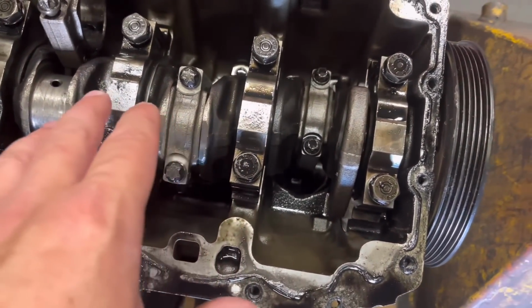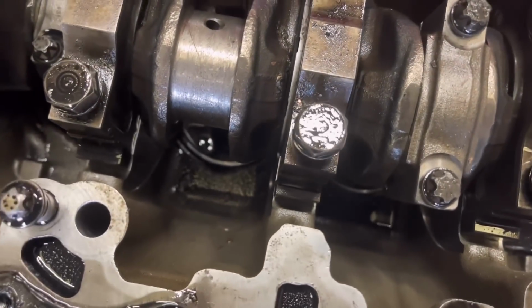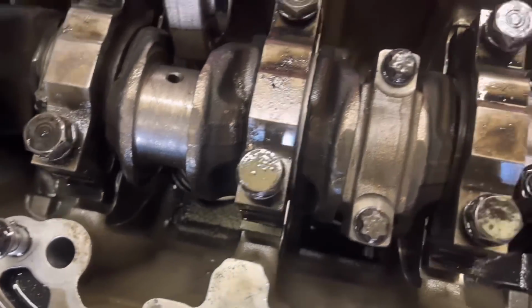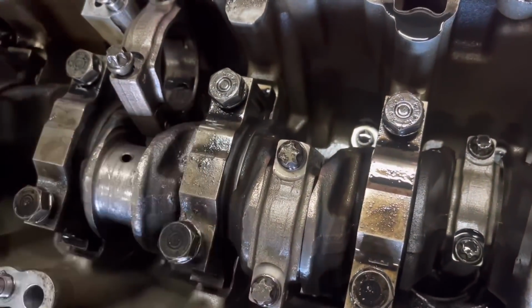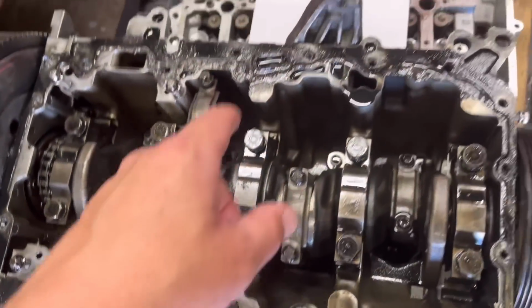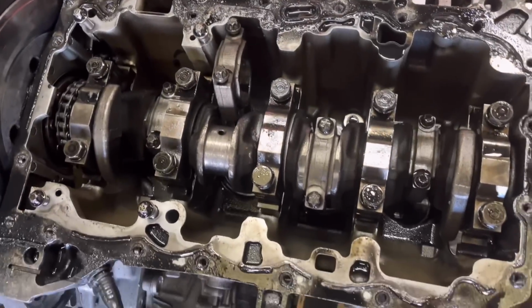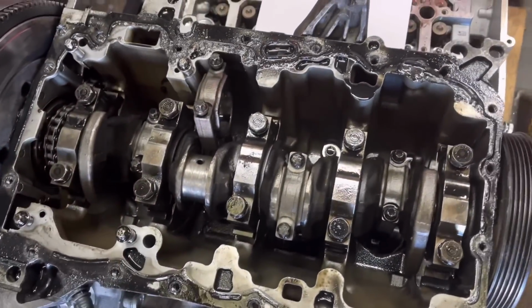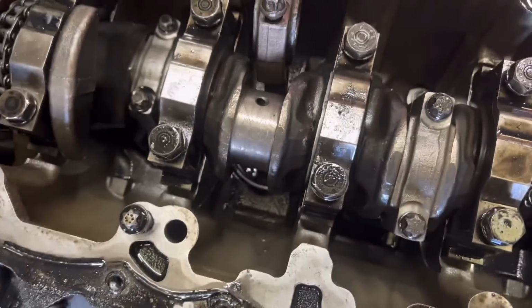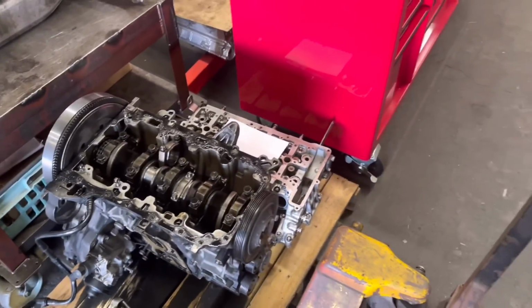The mains were actually okay, but you see this big end here. Now, just by looking, that big end there has absolutely had it. It's spun a shell in the rod, so the rod's obviously scrap. You can see on the face of the cylinder head that the piston's been hitting the head, and that's usually a good indication that the big end's gone good and proper. But yeah, you can see that is absolutely mullered, guys. So the crank is going to be almost certainly bent.